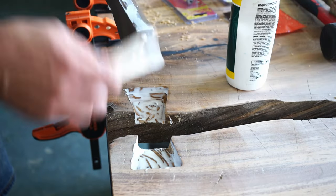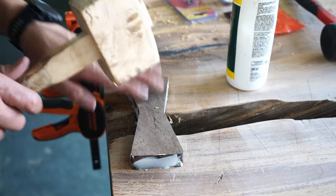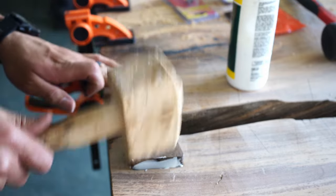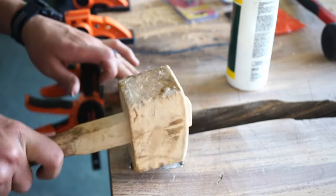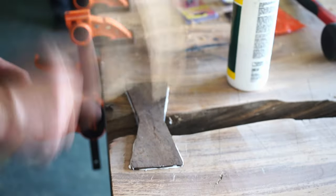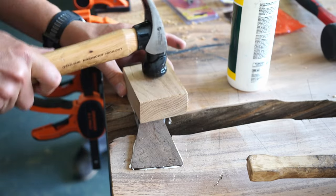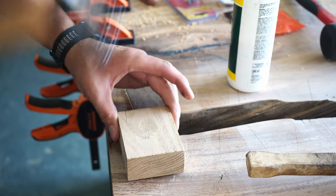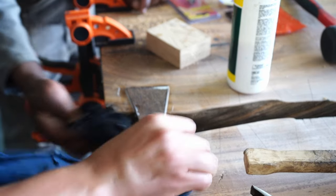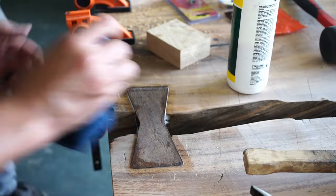The wood species for the bow ties is called leadwood. In Afrikaans, it's called hardekool. It's an extremely, extremely hard wood. I wanted to go for a really dark wood so the feature can really stand out once the table is finished. When cutting my bow ties, I really didn't want to cut in too deep, so you'll see the bow ties not sitting flush with the top of my table. I was scared of cutting too deep, and then we'd have level issues at the end of the day.